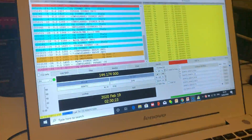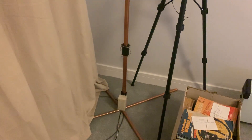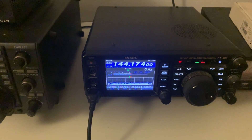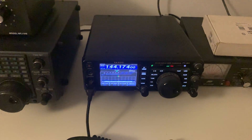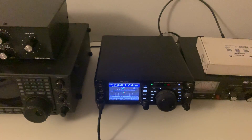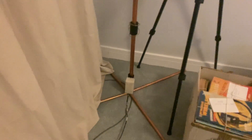Not too bad for the first hour of operation — it proves that the system's working. What's perhaps a bit more surprising is that the antenna I'm doing this with is here, which is a homebrew collinear built for me by a guy that works for me, G1ZMA, a fellow radio ham. It was constructed from some old copper piping that was lying around and is currently sat on the floor in my shack near a window. I'm putting 20 watts into it at the moment. I know this antenna works really well because we tested it about a week ago — he lives about three miles away from me — and with five watts into this antenna, my signal at his QTH was 60 over 9, with it sat on the floor of my shack.